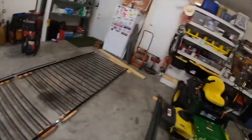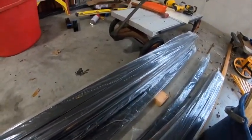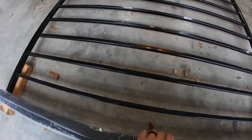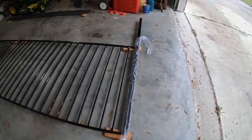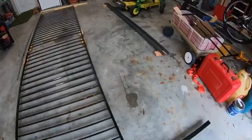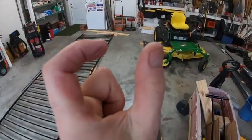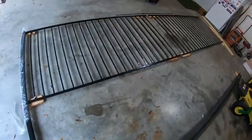These are all packaged in groups of two. Then on the ends here we'll come in and put a nice heavy bar on the ends to dress the gate up — of course we'll cut it off up there where it's nice and level. The last thing we're going to be doing is fabricate this angle iron. This angle iron may be a little bit too thick for what I want to do, so I may have to find something else. We have to form a rail because there are two rollers that will fit on either side of that angle iron to keep the gate straight when it's going up and down. That's what we're working on.